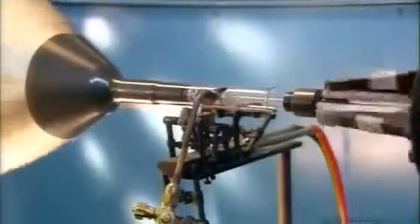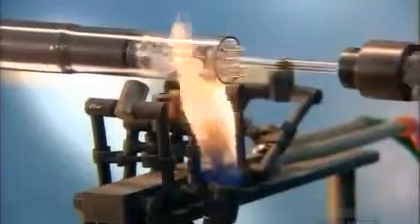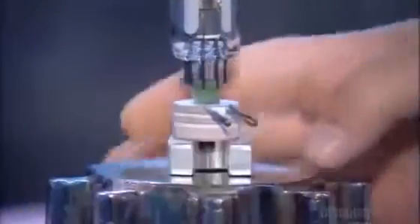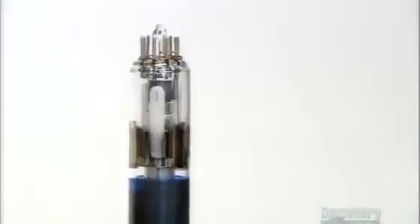Next, he positions the bulb on a glass blowing lathe and cuts excess glass from the neck. Using a graphite paddle and a high-temperature torch, he mates the glass neck to the electron gun's stem. A ceramic heating coil melts a green glass pellet to keep the bulb under vacuum. The tube is heated to 400 degrees Celsius for two hours, and once again a vacuum is drawn. To minimize image flicker over the tube's lifespan, workers condition the bulb using a high-voltage coil, which smooths any rough surfaces that might remain on the electron gun.